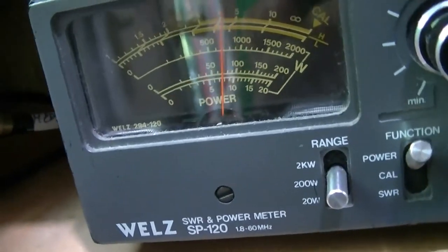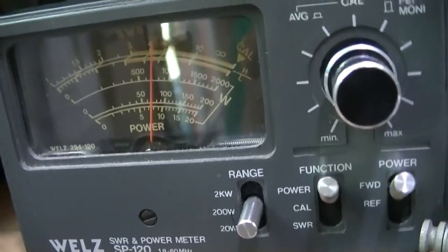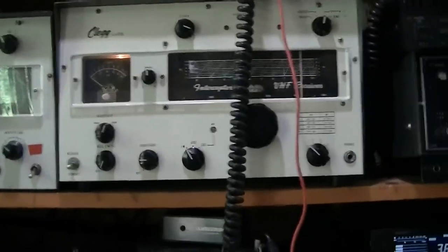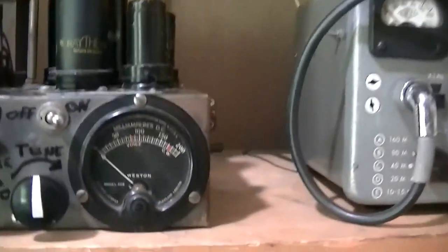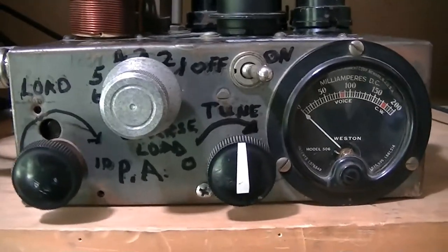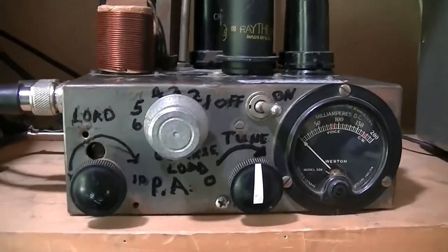With the amplifier we're getting — sorry for the reflections — 65 to 70 watts of carrier. This is W6WUH. There's the peak reading watt meter, and you can see it's modulating very well with peaks of about 125 watts. We've got it set up with the Clegg Interceptor with the HF converter on 3870. We'll put it on the AMI net tonight. We're seeing 50 milliamps of plate current, so it's about 15 watts input and about 7 watts out — not terribly efficient, but that's what it's doing.